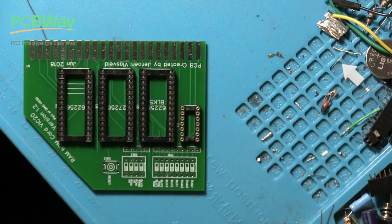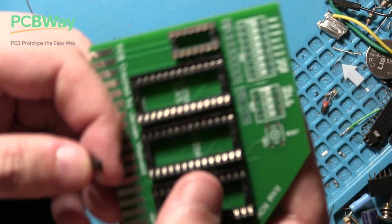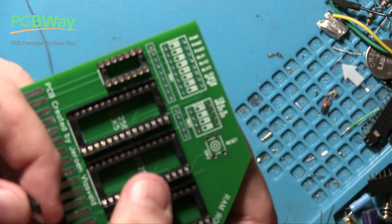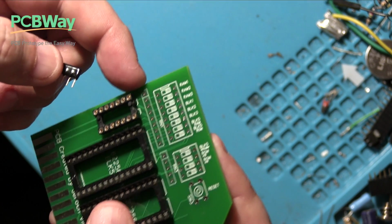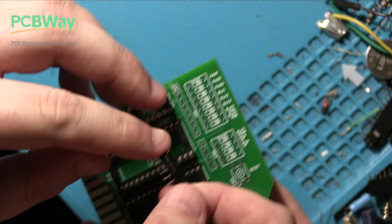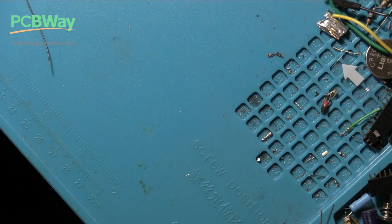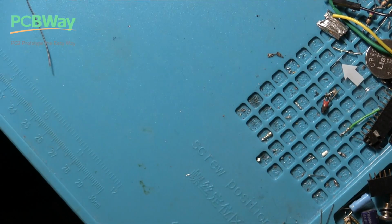Now then, slightly harder will be these resistor networks. Now, for these, to see how well we can focus, probably not well. On here you'll see, well on this one, it's got the square contact, which is the ground. On this you'll see a little dot, which is the ground, so just make sure those two line up.